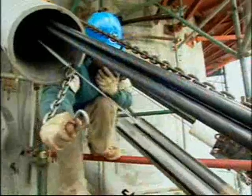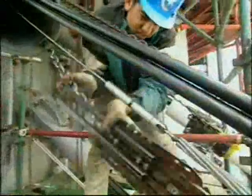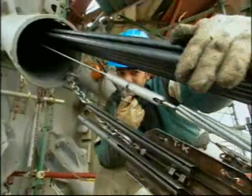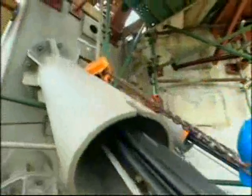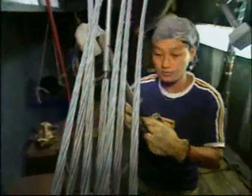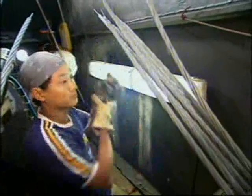Using a wheeled detachable trolley which prevented chasing, each of the strands was pulled up inside the sheath. The sheaths have an external helical protrusion which reduces rain-wind-induced vibrations of the cable. Within the tower heads, each of the strands was stressed by isotensioning.